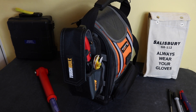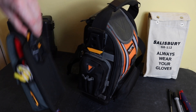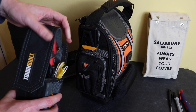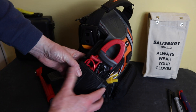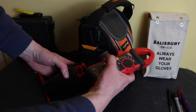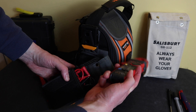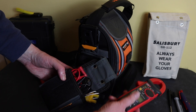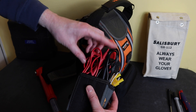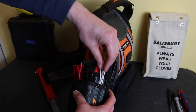Around this side I have the meter pouch from ToughBuilt, which unclips off the handle. The ToughBuilt pouch is housing this clip-on ammeter from UNI-T — the UT216C. It's adequate for my needs: I'll do current measurements for charging currents, and I can also do voltage measurements for the overall voltage. It comes with standard leads and a thermocouple so I can measure battery or charger temperature.